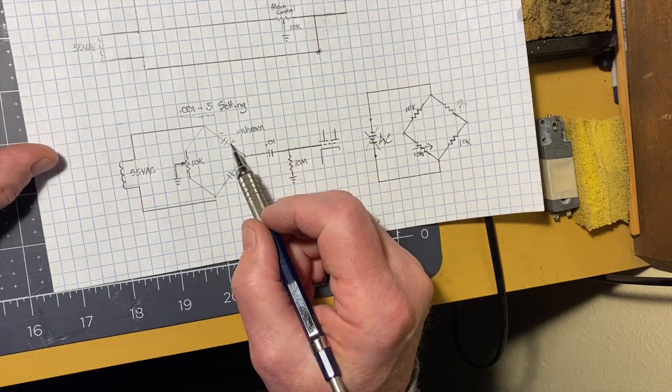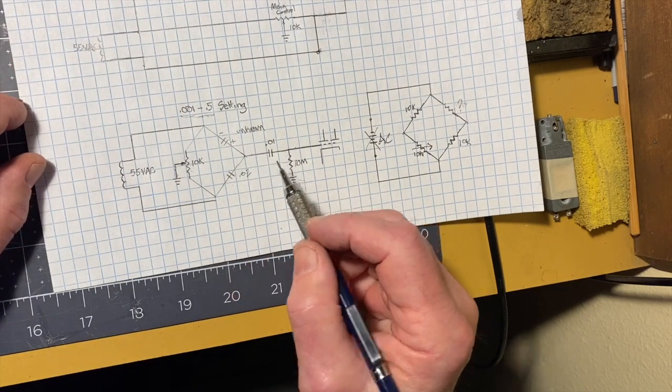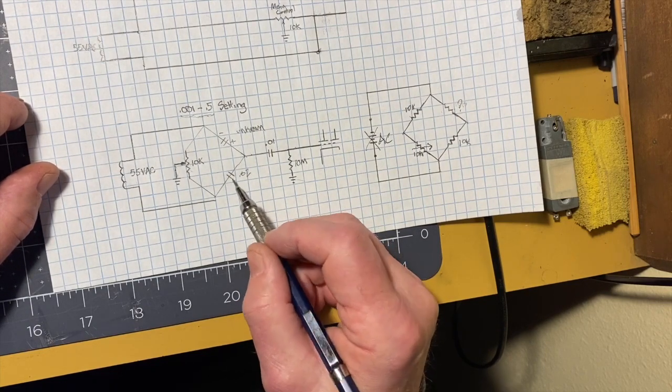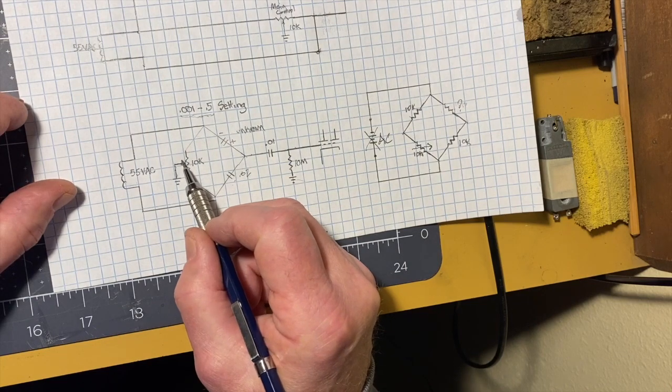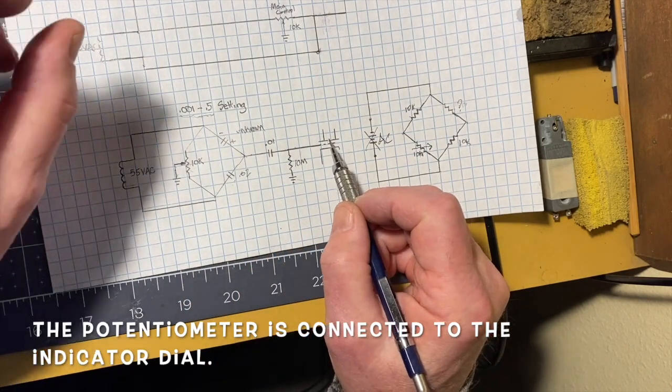So we had our test capacitor, a 4.7 microfarad capacitor, in here. We knew we had a 0.02 in here, this fixed one, and then we adjusted this pot up and down to get 0 volts here so that the magic eye was all the way open.